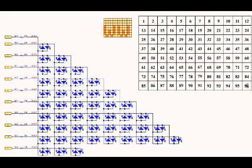That means 96 LEDs. Using the charlie-plexing technique, if n is 10, for example, that is 10 pins, then n square minus n is 100 minus 10, which is 90. So you can only control 90 LEDs. That means you need 11 pins. 11 square is 121, minus 11, comes to 110. So using 11 pins, we can control up to 110 LEDs, whereas we have 96, which is okay. So you need a total of 11 pins.